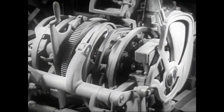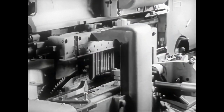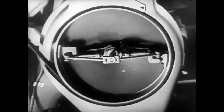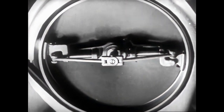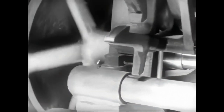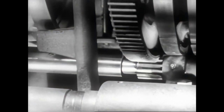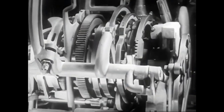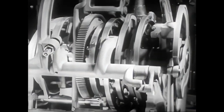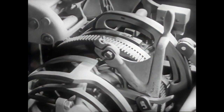The cams begin to rotate as soon as the delivery slide carries the matrix line into the first elevator jaw. This releases a stop in the delivery cam at the rear of the machine. The two friction shoes of the driving clutch are then pressed against the inside of the driving pulley, thus causing the driving shaft to rotate the cams. At the opposite end, this shaft has a pinion that transmits the movement to the large driving gear on the cam shaft. The cams are thus made to rotate. Every complete turn of the cam shaft corresponds to the casting of a slug.